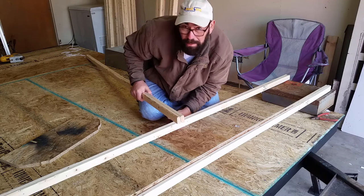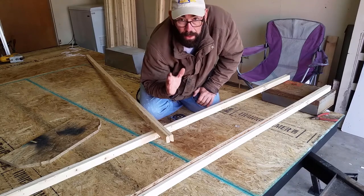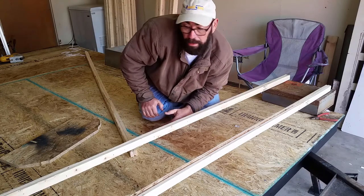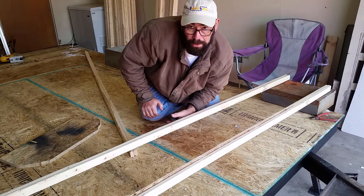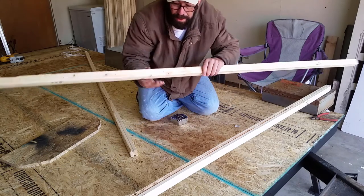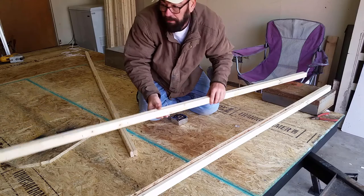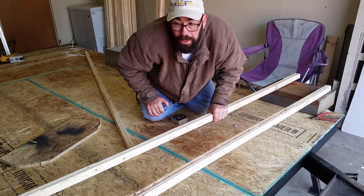I'm not going to do that on my walls. I don't have to worry so much about deflection in and out, because there's not going to be a lot of weight on it all the time. The weight is actually bearing straight down from end to end, not side to side. That's why whenever you look at a house being built, the walls can be two by fours, but the ceiling joists and roof joists are typically two by six or two by eight, depending on how wide the span is. Basically, what I'm doing is changing this from a two-inch — by putting metal in it — into basically a two by four. That's how much of a change it'll make. I shouldn't see any deflection at all. When we get to that point I'll show you exactly what I'm talking about. But for right now, let's move all this junk out of the garage to start laying out walls.